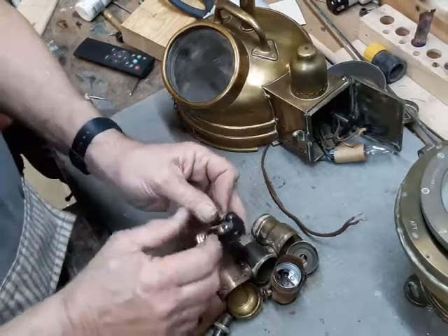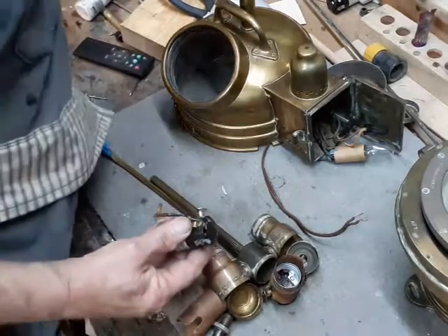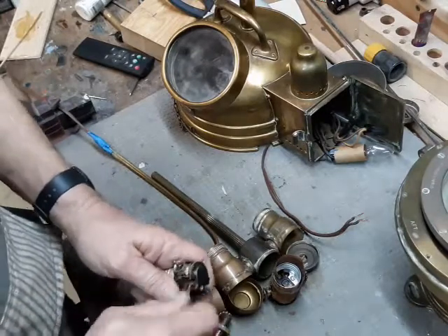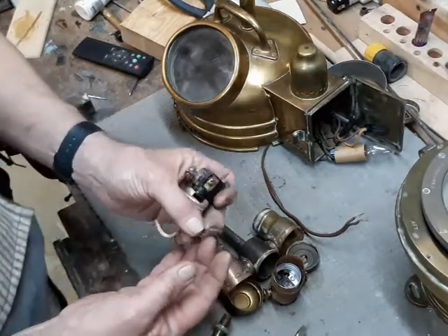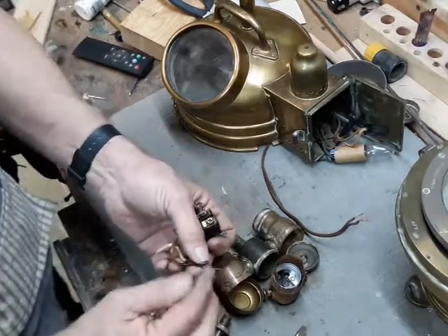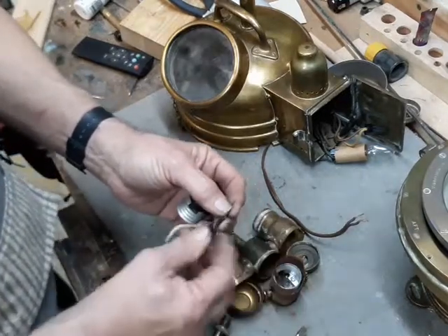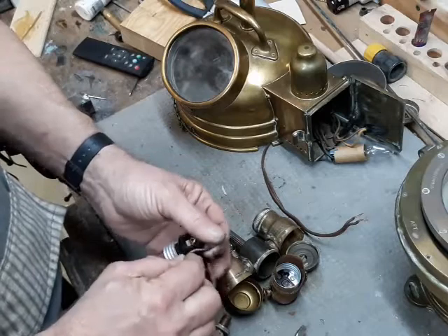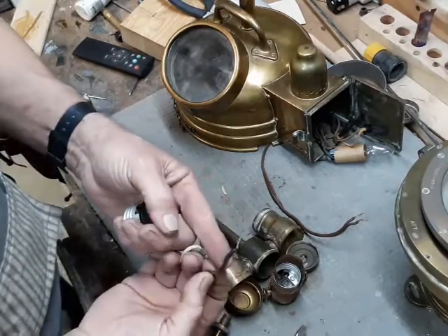The only reason for that is because this screw has come loose, which gives me a chance to talk about one of my favorite things: why the ends of wires that go under screws should always be tinned. Tinned means soldered — you take all these little strands of wire and make it into one wire so that it goes underneath the screw and clamps down tight. It's really not possible to get stranded wires under a screw nice and tight as it needs to be. The heating and cooling makes those wires spread out as they expand and contract, and eventually they get loose, and a loose connection gets hot. We have a wire right there showing obvious signs of heat damage.